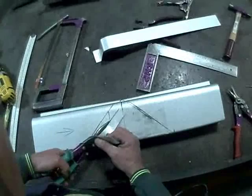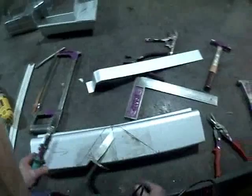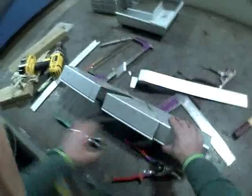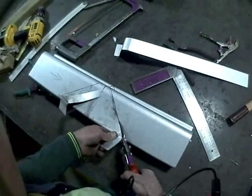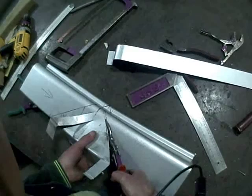Cut along the line, and continue that cut all the way up because these other cuts need to be very accurate — best to do that after you've removed some of the material. Cut the back — this time we need to cut on the line, there's no lap on this side, only a lap on one side. When the snips start to bind, go to the other snips, cut a section up there, pull it out of the way. Remember earlier we marked a 5mm allowance for where the two bits of the front corner meet together — leave that on there. Then cut around there. Take that triangular section away and save it for later — we'll need that to form our gusset.